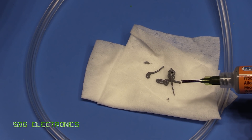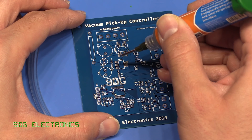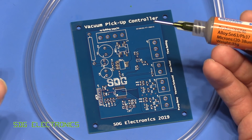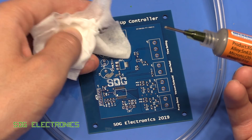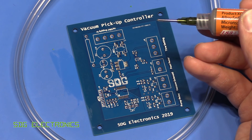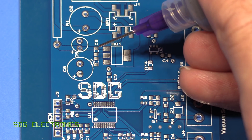Let's try it with the timer and see if we can place paste on the PCB. That's a little bit generous with the paste. Just be careful with solder paste generally — it's not great for you and you don't really want to get it on your fingers. A little secret: baby wipes are amazing for cleaning up solder paste. Okay, that needle is a little bit too coarse. This finer needle still seems to dispense okay, so let's try placing some 0805 parts.